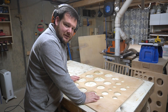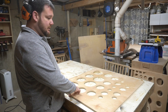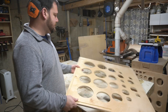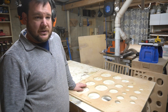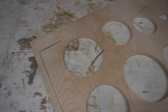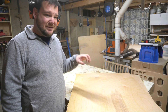I've got all the pieces almost cut out — I went eight for nine. I can only get three blanks out of each piece of plywood, and I bought three pieces, so I had nine total. I was cruising along feeling good, cut all the pieces out, and then on the very last outside contour tool path the bungee cord on my dust hose fell off, got hooked around my Z axis, and lost some steps — it cut the corner short and wasn't savable. That meant I had to go get more plywood to cut that last piece.